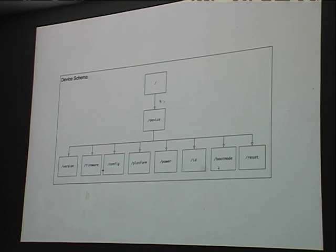So here's a basic schema, getting into some of the messages that the device understands and can generate. Things like what version, what CPU, what's the platform, how much power do I have, and where is that coming from? Is it the USB bus or is it external? What ID am I? And I can initiate a restart or go to the bootloader.